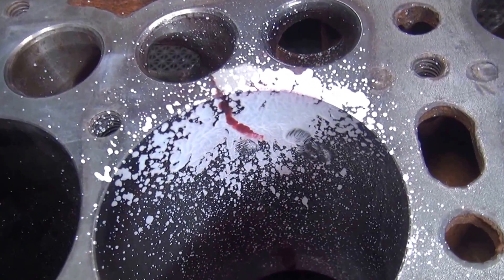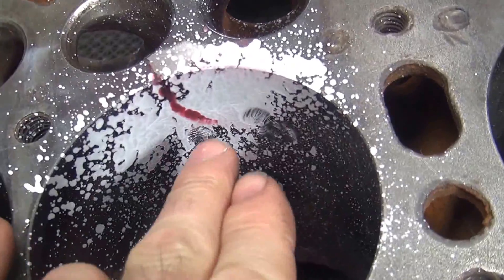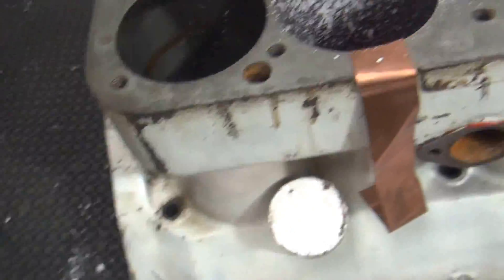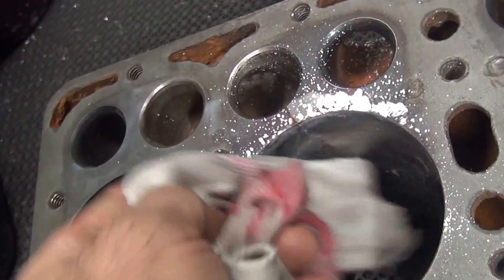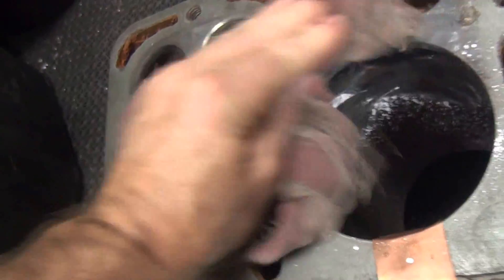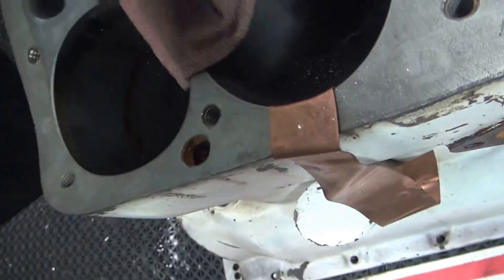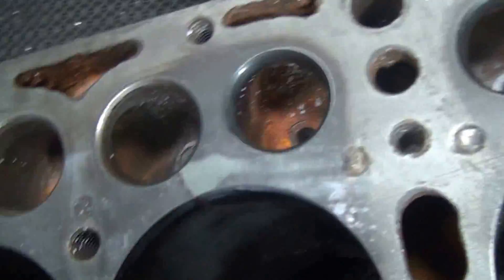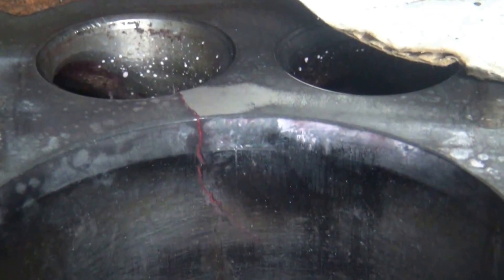Checked here for the crack to see how much further it went. I've done this twice now and get the same thing — I thought it cut across about a half inch but it's not showing that here. You can see where that crack goes across right there and ends. The one going down the cylinder is not a crack, so I'm going to center punch the end of that crack so I'll be able to set up the drill and then start plugging up the side of the cylinder like we did on the other side.